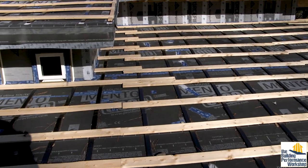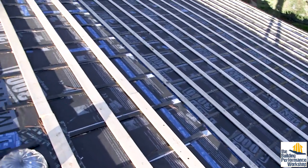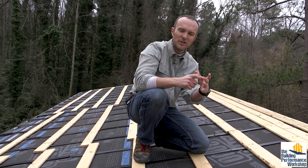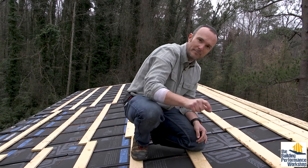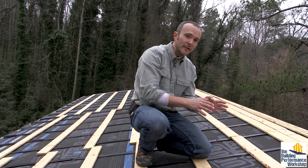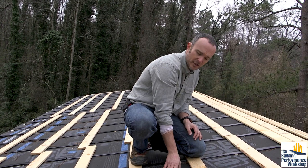With this vertical plus horizontal configuration, we have, first of all, more material. We have the challenge of finding the roof rafters and making sure that we only screw in at the intersections. And I'm only using 1x4s here. Matt Reisinger's solution — and I don't know who invented this — is to use a 2x4 and coat the backside with butyl tape. This right here is a one-and-a-half-inch strip sitting on top of a two-inch-wide butyl tape, so I don't have a lot of wiggle room. If you've got a 2x4, you've got three-and-a-half inches wide and you're going to butyl tape the whole thing. I don't understand whether it would need to be pressure-treated — I wouldn't want those chemicals washing over my house — but I don't understand how you would protect a bare 2x4 from rot sitting here.